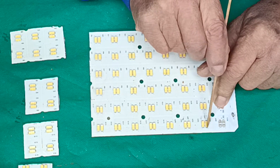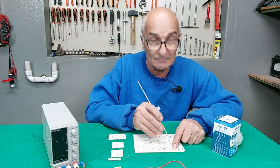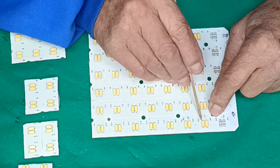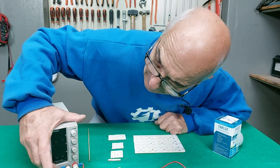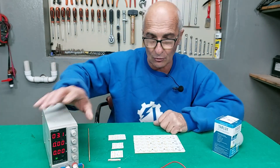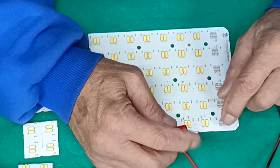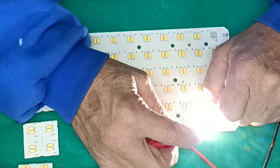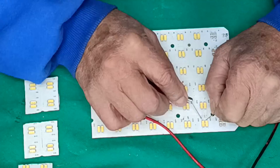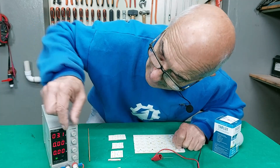Here we have a negative input from this side. This side of the LED is positive, joined here by this board. There are two LEDs of 3 volts each, or 3.5, but I use them at 3 — giving us 6 volts. Let's see how it works now. I'll set the source to 3 volts, 3.1. I'll put the negative here and the positive here, and that LED will light up almost at full. If we connect here, we'll see it doesn't light because it's in series and the voltage isn't enough — for that we'd need 6 volts.